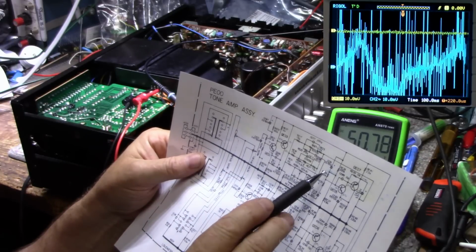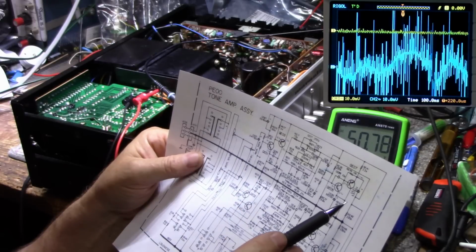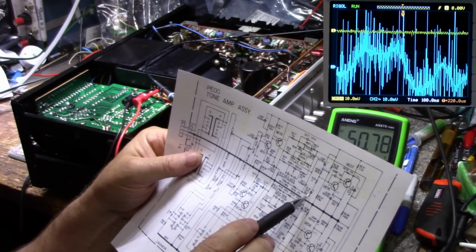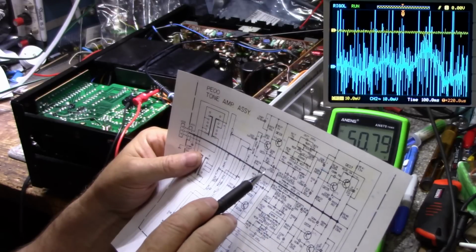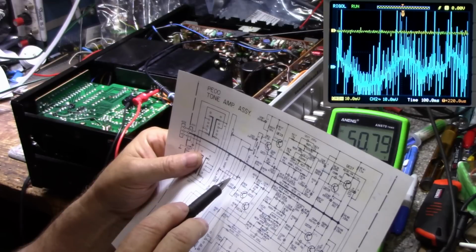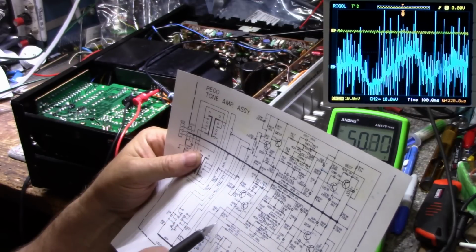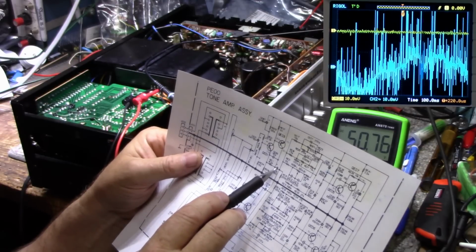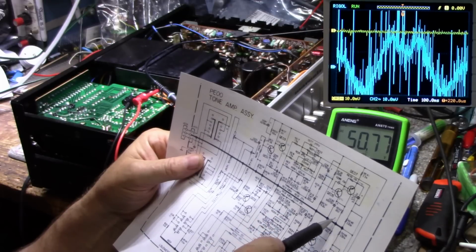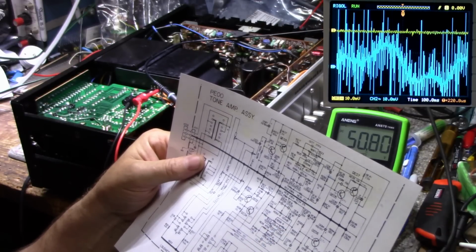That's another possibility. I have some 22 microfarad at 50 volts, 1, 2. I have a 0.47 at 50 volts. I think that was replaced with a film. 4.7 at 50 volts. That is on a signal output. That is a coupling capacitor, a DC blocking. Here's another one, 3.3. These are blocking, so I don't think that's part of the problem.